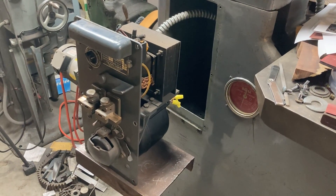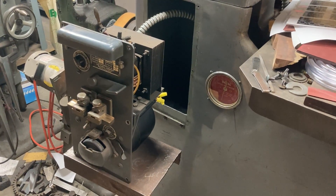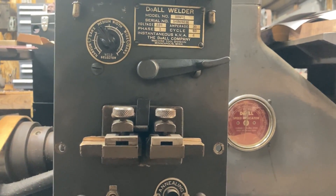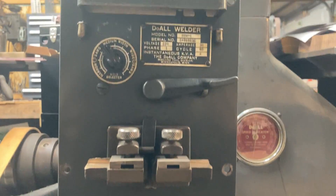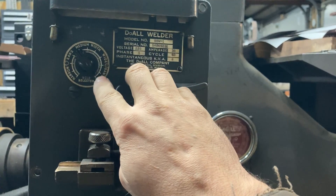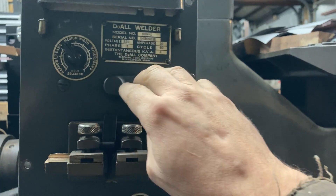I was having trouble actually getting a good quality weld. When I first got the saw I got a few welds that were okay — there's a little bit of a learning curve — but now I can't hardly get the weld to even stay together, let alone come out without breaking or be grindable to a good-looking weld. I fooled around with a few of the settings on this welder. The main one on the front here is this knob — the farther clockwise, the wider a blade width it's set to. This will only weld up to a half-inch wide blade, so I have it set all the way to the right. I fooled around with that a little; didn't improve things.